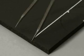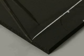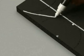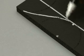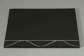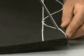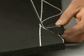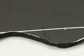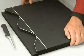Now cut along the line drawn to obtain the shape desired. As it is a rather tedious operation, it is better to copy the shape onto other pieces, keeping them ready for use. Remember that 2 pieces can be made at the same time, the profile being symmetrical. Taper the tips of the piece and leave the lower parts flat.